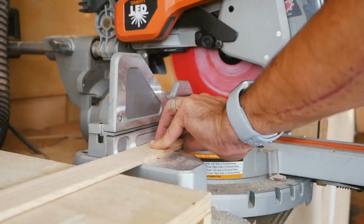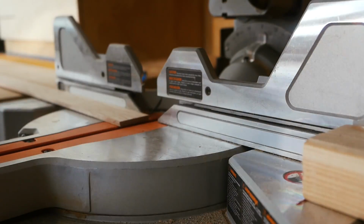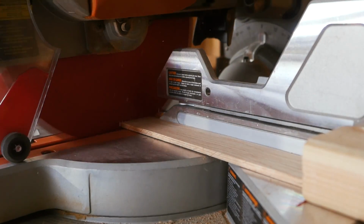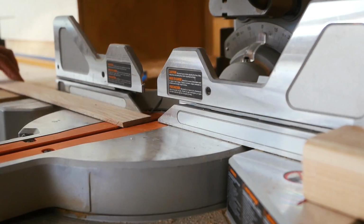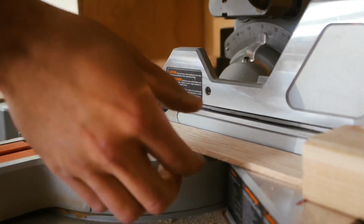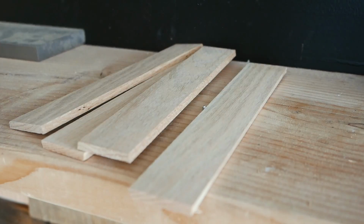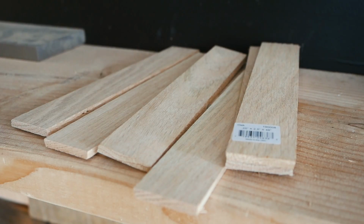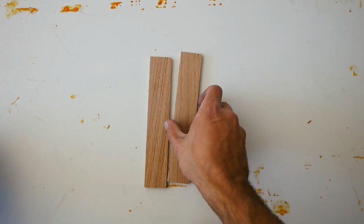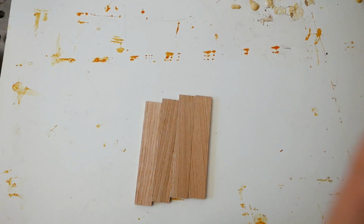Now, after we got all the lengths on both sides all tapered and angled the way we wanted them, we had to kind of chop everything up to accommodate the overall height of the beer stein. So we brought everything to our miter station. Now, the trick at this point is to create repeatable cuts, right? So we created a little stop block, which is basically a scrap piece of wood that we screwed right into the plywood of the miter station. Once it was there, we just kind of bumped all the wood to it and kind of sliced and diced as we went. Now that we got the overall pieces, and I think it came out to about 15 pieces, all at 78 degrees, and the overall height was 5 inches. Once everything was all laid out, we were ready to proceed.